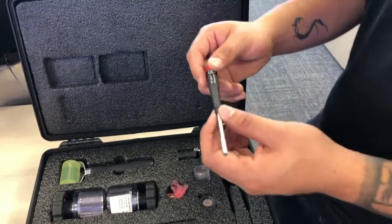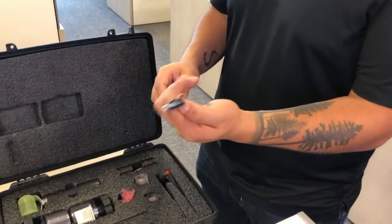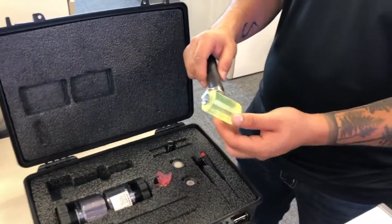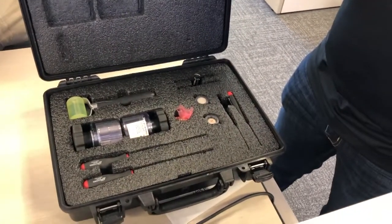This tool is used for taking the magnet plates off upon assembly. If something's wrong with the magnet plate, you can take it off and repair it or send it back for an RMA. Here's your locking key for the box. This shader isn't really needed with these smaller pitches, but it lays on a shader used with bigger pitches — 1.5 all the way up to 2.5mm. The way we measure LEDs is center of diode to center of diode. With 1.2, 0.9, and 0.7mm, the center is very minimal. Once you get to 1.5 and 1.8mm, it's a little thicker, so these shaders allow customers with bigger pitches to get the deeper, darker blacks you still get with the 0.9s and 0.7s. It's essential to keep this toolkit close to the video wall just in case something happens.